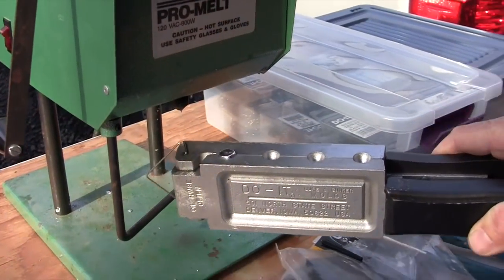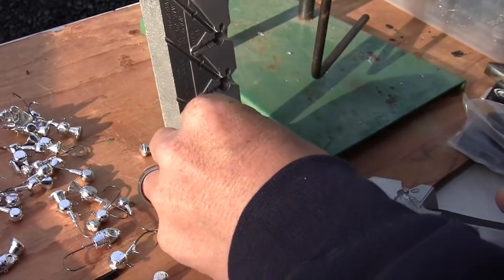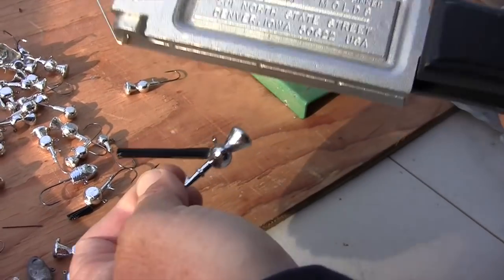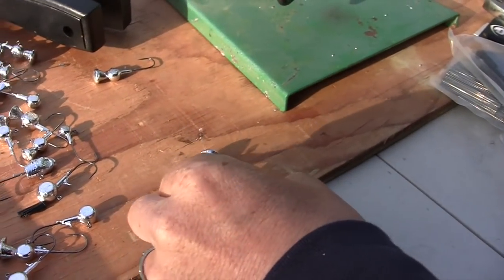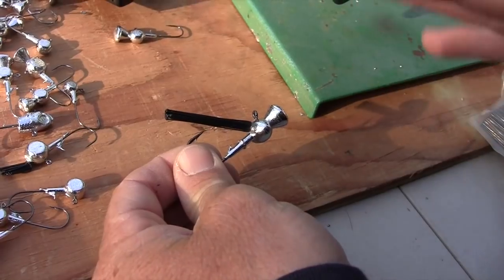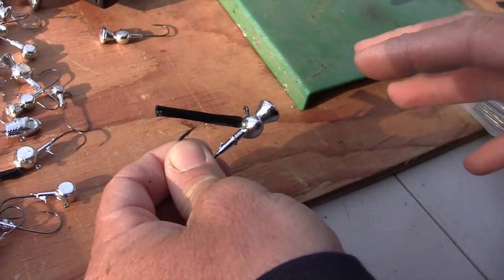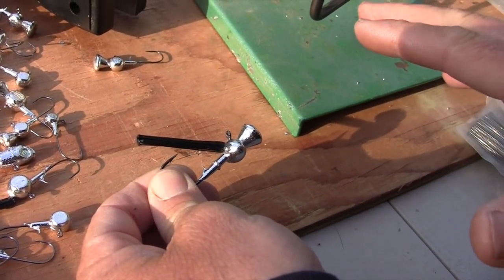And then you pour it. So there's advantages and there's disadvantages to doing it this way. And this wasn't completely perfect, but almost. I messed up maybe one guard or two and cut it down, it's no problem. The advantage of this is you can use this hook without messing up the mold and doctoring the mold. You could probably Dremel it out and get it to work to where you could offset the hook, but I haven't done that. I do it just as is.